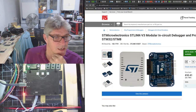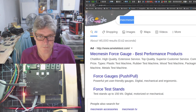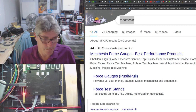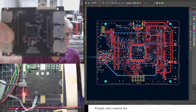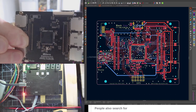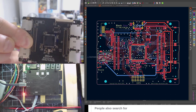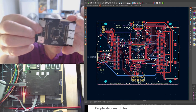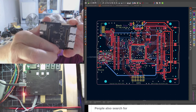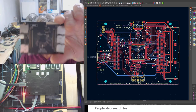Any other stuff that we need to cover? Did you see the new version of the BlackEdge board, the system board? How it was before on the dev kit, we got a slightly different version now. I've made some changes. This blade is not there any longer. We're down to three blades because that was impeding, or could possibly impede, where it sits above that new XT30 power input for the tiles. And then I just moved the USB up to the top here, and there's a header at the bottom here where the pins from the missing blade go.